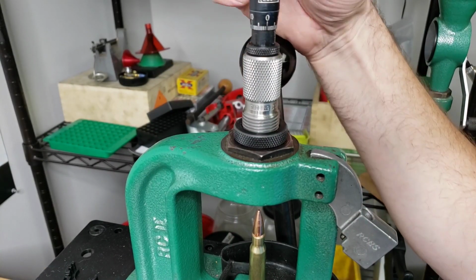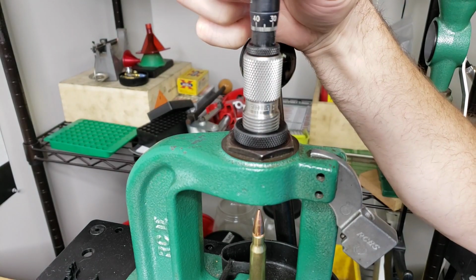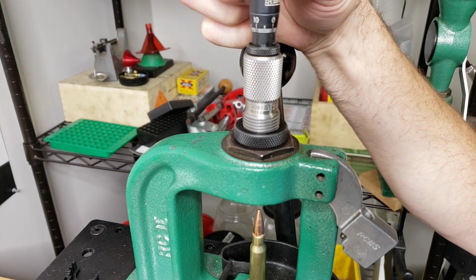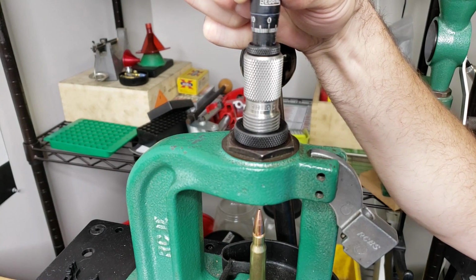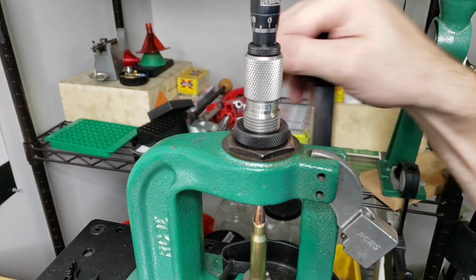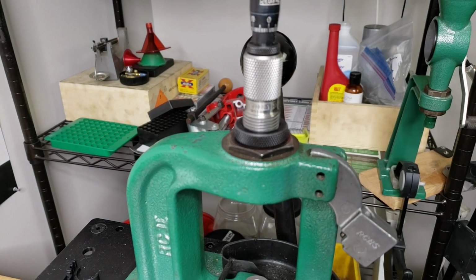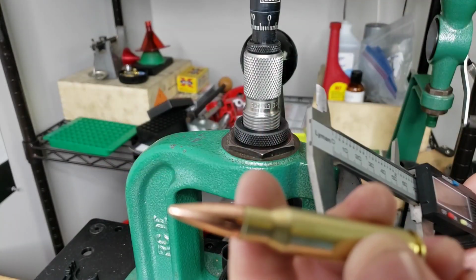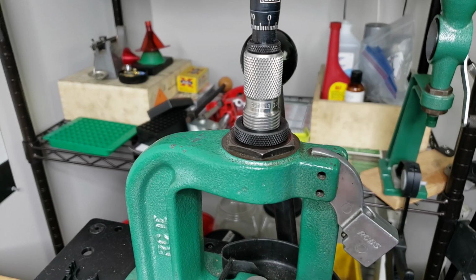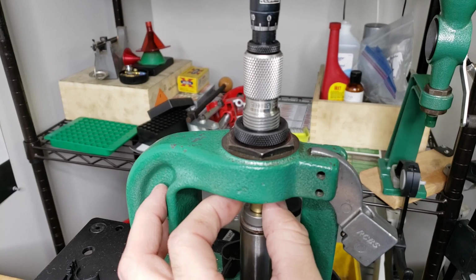And with our micrometer, that means to just come down by 0.5, which should be that. Hopefully, let's give it a shot. Felt like a nice smooth pull of the handle. And we're at 2.72. And we might actually be compressed now, which isn't necessarily a bad thing, but let's run it again and make sure we're nice and concentric.